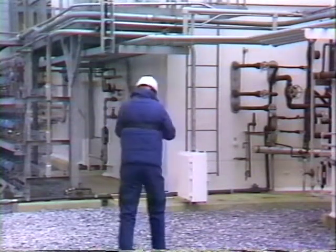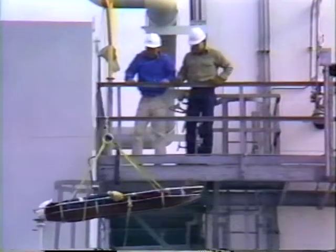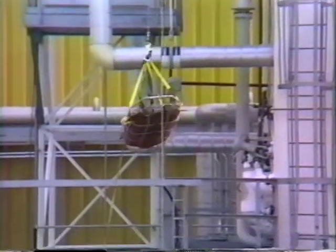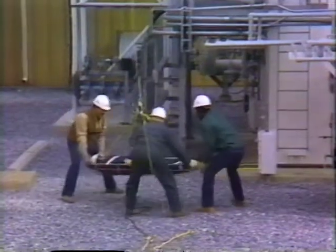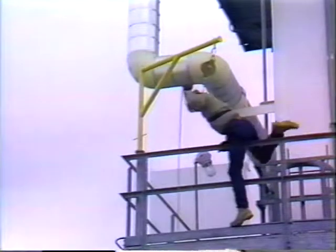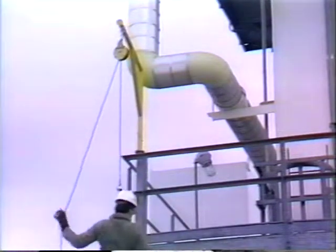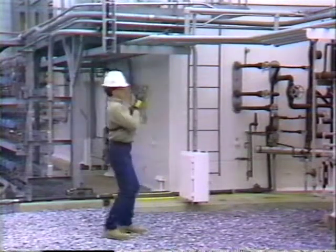This system has been specifically designed for individual emergency descents from elevated work sites, as well as for the removal of injured personnel from higher elevations. No electrical power is ever needed to operate the unit. It works by gravity and automatically adjusts to your weight. The centrifugal braking system safely lowers you at a constant controlled rate, about 3.5 feet per second.